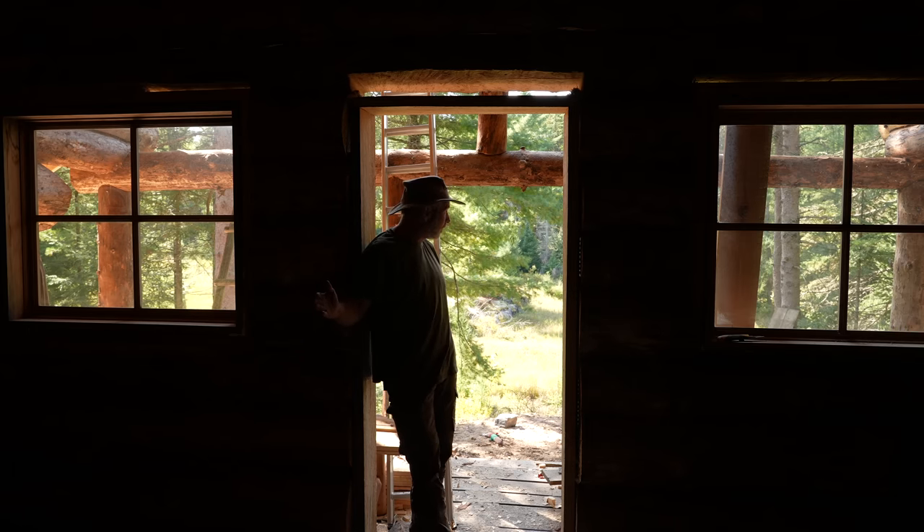The gaps are going to keep opening and closing a little bit. I chalked a line down the center and put screws in mainly at the end joints and random ones throughout the center. What I'll do is take those out, and as I take each one out I'll drill a larger countersink hole, screw it down — this floor is a full one inch, maybe slightly over, which is why you see 'four fourths' marked on some boards, since the mill is set up in fourths. So I can do three-fourths, five-fourths, six-fourths — inch and a quarter, inch and a half, and so on.